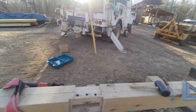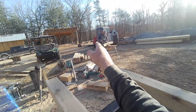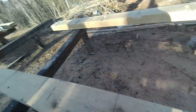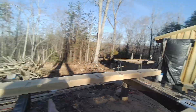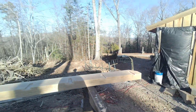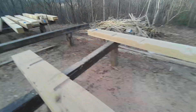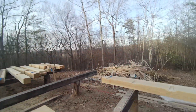All of the pockets we just went through are cut and chiseled out and ready to be finished. Jay's over there finishing the knee braces, putting the final touches on before we can stain them. The last thing I need to do is match the dovetails for the joist on the main beam. We've already marked our centers of where I need to be. All the final pockets on the front beam are finished and ready to be sanded and cleaned up — just like Jay's got that whole other package ready to be sealed tomorrow.